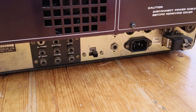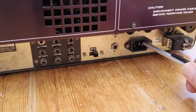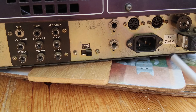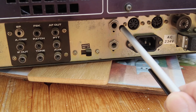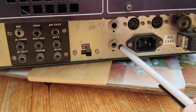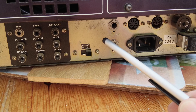There's a socket that can be used to connect to a 12-volt supply, with a dummy plug sitting in there when not in use. We have the AC input - a typical kettle lead socket. Above that we've got two DINs labeled accessory one and accessory two, with various functions including connection of a linear amplifier. There are two key jacks - one for a keyer if the keyer board is fitted, and one for a straight key. We've also got a memory backup switch, though it doesn't seem to have any effect in this radio - possibly the battery has gone or the board isn't fitted.